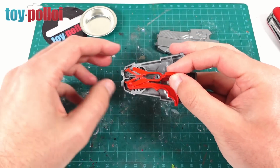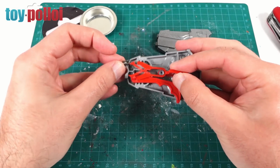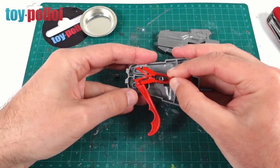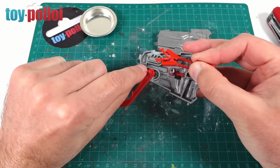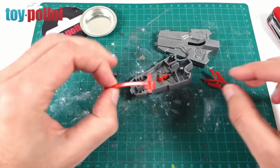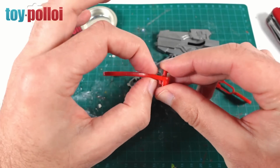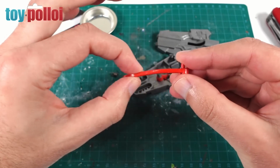There's multiple issues with this. There is a spring that should pull this middle lever forwards so that it's permanently in this forwards position. You then pull it backwards to pull the claws out. The post that it sticks onto should be here. That has snapped off, so that's why that is no longer working, so we need to rebuild that post. Then this claw is bent. You can see it's got a big curve to it, so we need to fix that. That's fairly straightforward to do. I'm just going to put that into some just boiled water and reshape it.